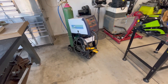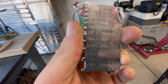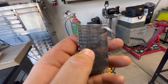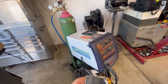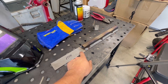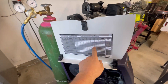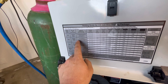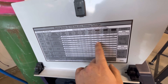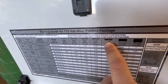We're going to stick two pieces of metal together — they're going to be eighth-inch in thickness. I pull up a gauge like this and measure the material. Both pieces are eighth inch — you'll see it is 0.125 wall. The tubing I'm going to be welding is 0.120 wall and an eighth-inch flat stock. I go up to the welder, pull the cover up, and this 110-volt welder has settings for carbon steel 75/25 and settings for eighth-inch material, so I know this machine will get best penetration for gas metal arc welding up to an eighth-inch gauge.